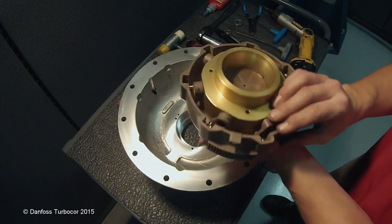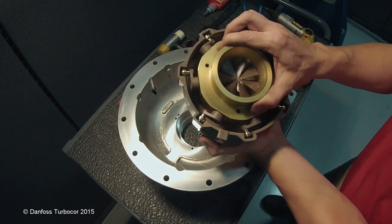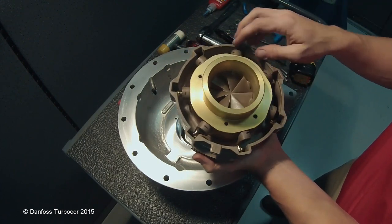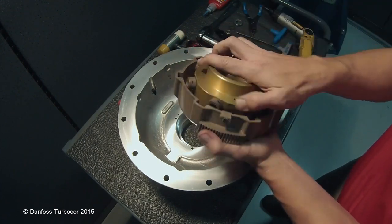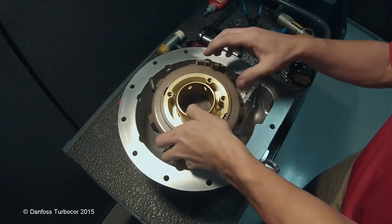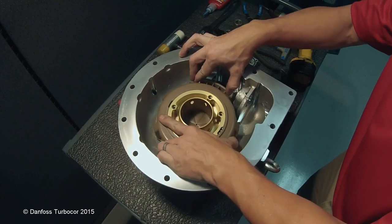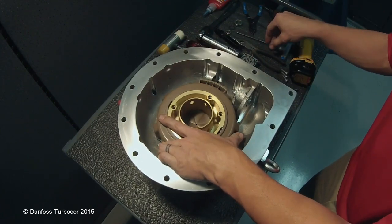If the blade levers get locked out of position, ensure they are facing the same direction and are down in the housing slots. With the blades in the closed position, place the throat assembly into the housing with the threads facing the worm gear location. Turn the throat until it hits the stop in the closed position.